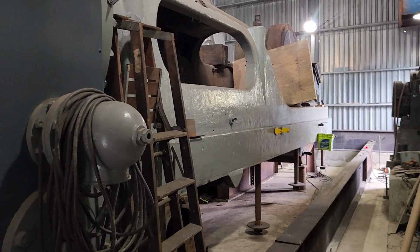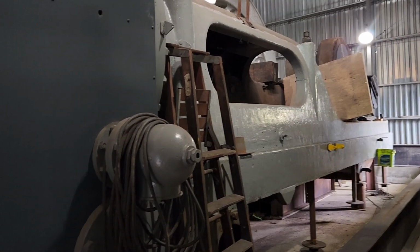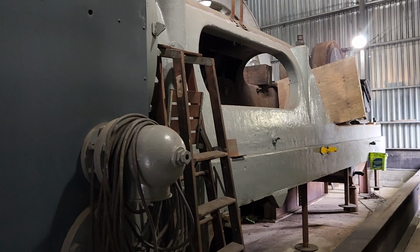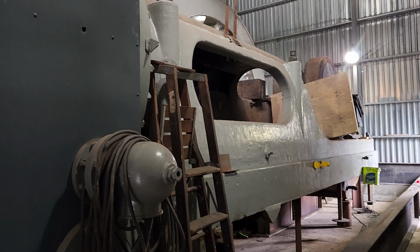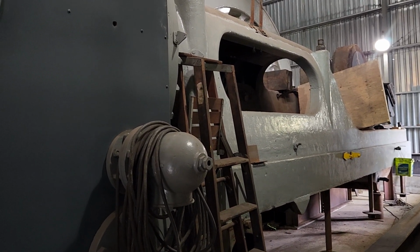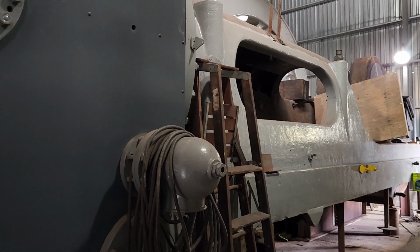Now, however, the sister engine to this, the continuous mill engine, which sat next to it at Briar Hill until 1935, ran under. So you had one engine running under and this one next to it running over. Getting it to run under is not going to be a big deal, because thankfully William Todd Company put on the drawings what you have to do in order to switch the rotation of the engine. It's basically where you put the governor wheel on the engine that dictates which direction the engine will run. One of the drawings has it denoted: to get it to run under, this is what you've got to do. That's what we'll do when the time comes.